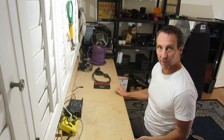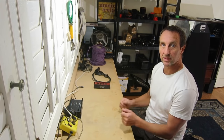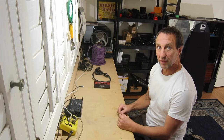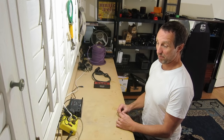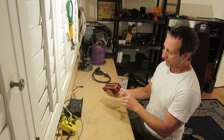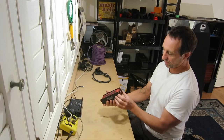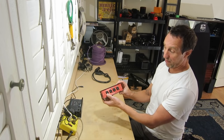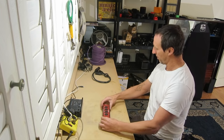Today I'm going to talk about some of the Cat system that the Sound Tools division of Rat Sound manufactures. Sound Tools started to make really simple, useful products, stuff that we needed for our rental department that solve problems or offer advantages, unlike other things out there. This is the Cat Snake box. It's an Ethercon in, Ethercon out, or Cat5 in, Cat5 out. Using shielded cable, it runs four lines of balanced XLR audio down a single Cat5 cable.